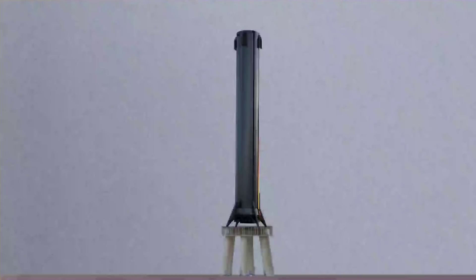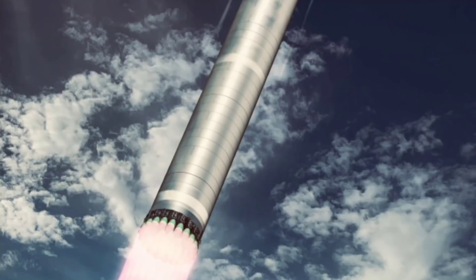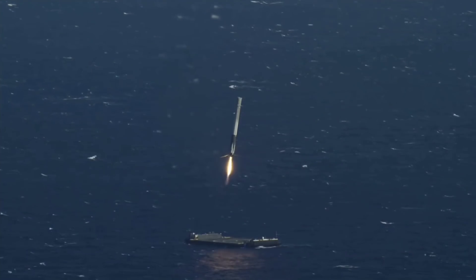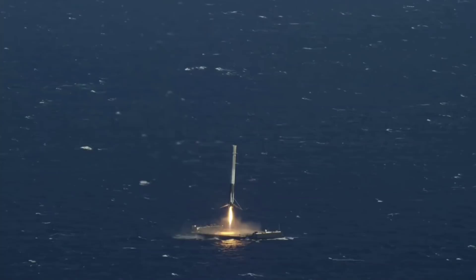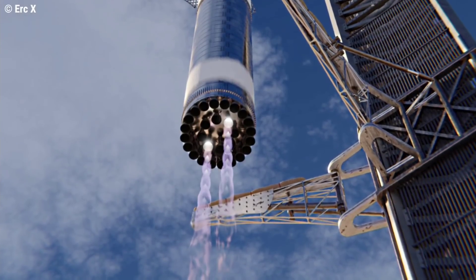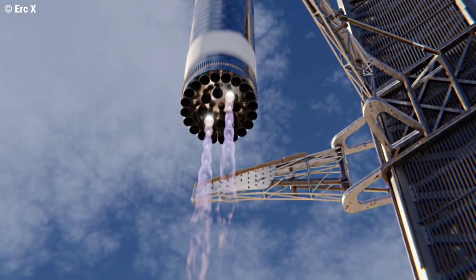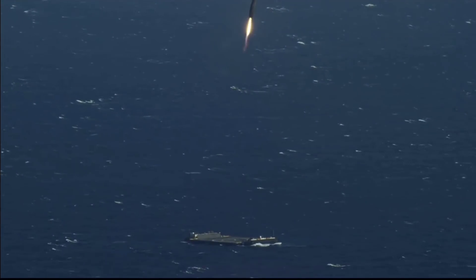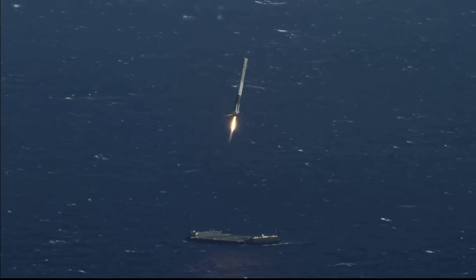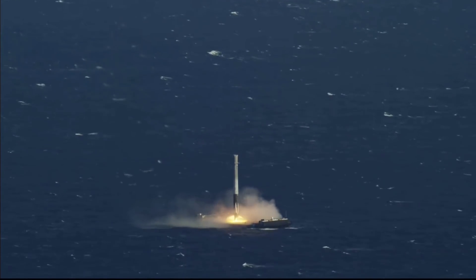Utilizing aerodynamic control rather than rocket propulsion — which at this point has been almost completely exhausted — Super Heavy is now mostly a hollow tube, weighing in at just about the lightest it will weigh during operation, but still the size of a 20-story building. As it falls through the air towards the landing pad, its cluster of Raptor engines remain quiet. Just as only the center engine fires for the Falcon 9's landing burn, for Super Heavy, at just the right time a small group of Raptors at the center of the vehicle will start back up with a cacophonous roar. Timing is extremely important as Super Heavy plummets towards the Earth's surface with barely any propellant left — slowing the vehicle down not too quickly and not too slowly.